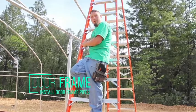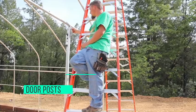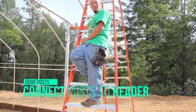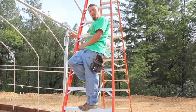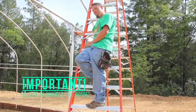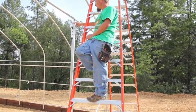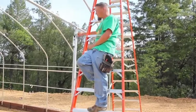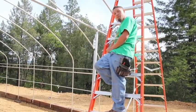Now we're getting ready to put in our door frame pieces. We have our two and three-eighths inch pipe with our T bracket assembly connected to it. You'll notice we connected the T bracket assembly at about 45 degrees — this way when we lay our channel on the outside of this pipe, these screws won't be in the way and it also makes a cleaner edge.